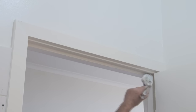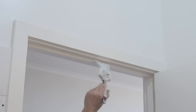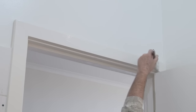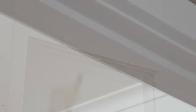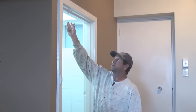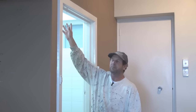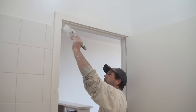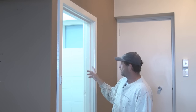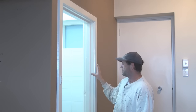Once you've done your back edge, go up and start painting the top. When you're painting, do your flat bits first and then do the face. Also, stop at that edge and leave that face for when you're painting the outside. Once you've finished painting the inside of the top, move on to the side and paint it all the way down, again leaving the face until you paint the outside of the frame.